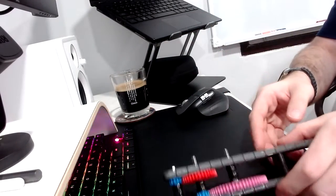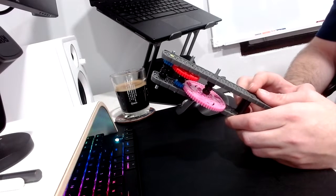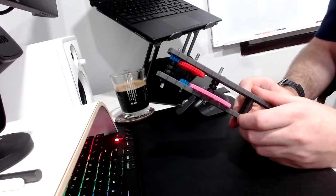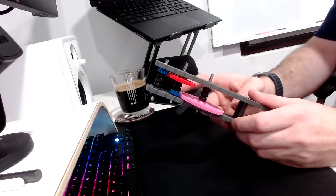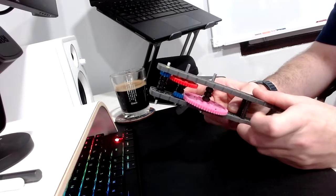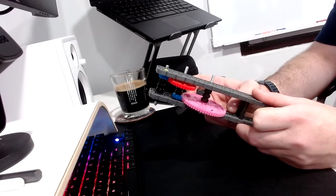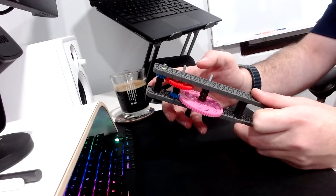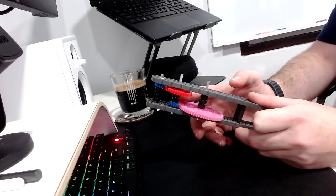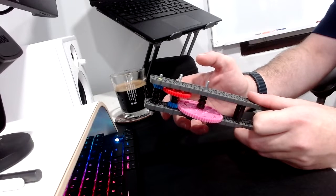What I want to have a look at with you today is compound gears, and I'm going to demonstrate how one of our students has used this on their robot and how they've used this same mechanism to create the flywheel on the pitching-in robot. You'll be able to see here our gear combination — this is going to be our driver gear, and if I turn this around you'll be able to see how much quicker this small gear spins at the top in comparison to the middle blue smaller 12-tooth gear here.